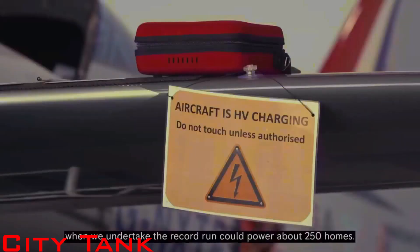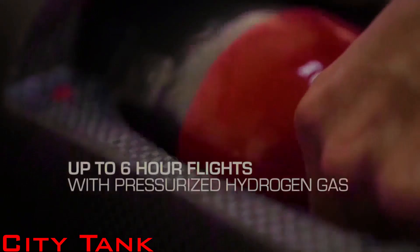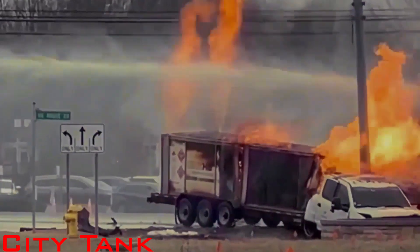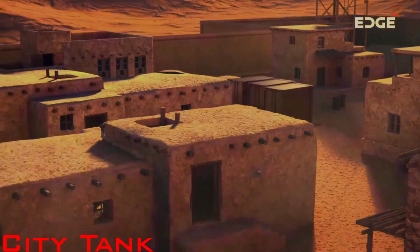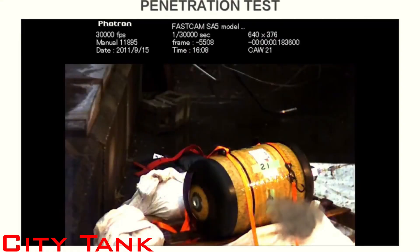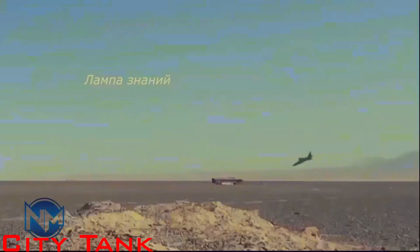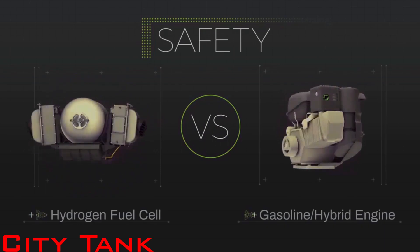Instead, we can use at least three variants of energy system. Variant number three is a hydrogen-powered suicide UAV — it has twice the endurance of lithium batteries. Hydrogen is explosive, which is just what we need: remaining fuel gives an extra blast effect to the UAV's attack explosion. Furthermore, the carbon fiber composite cylinder storing hydrogen provides extra rigidity to the fuselage, increasing the payload ratio with less total weight and more warhead mass. Though the hydrogen energy system is not as robust as a combustion engine, there is a better solution.